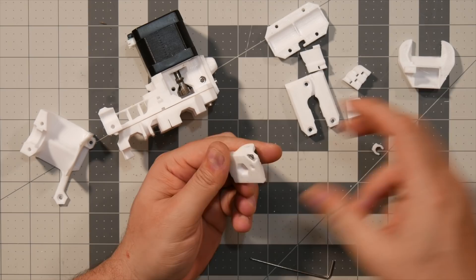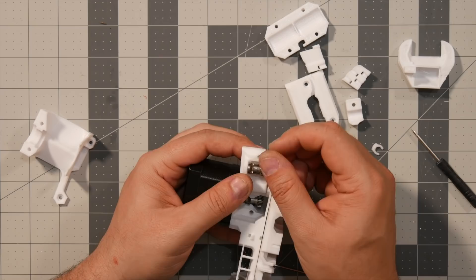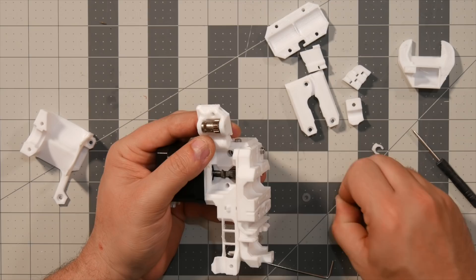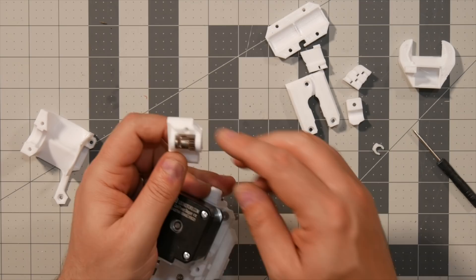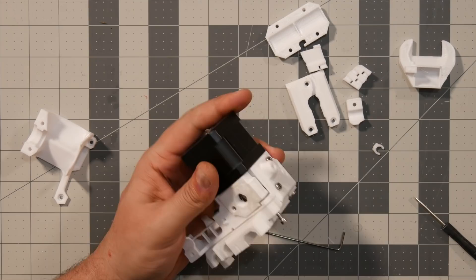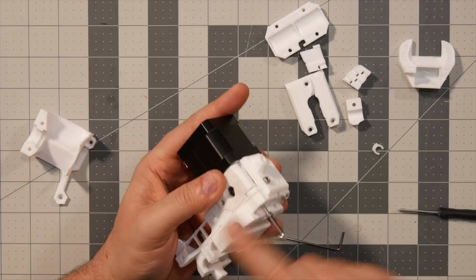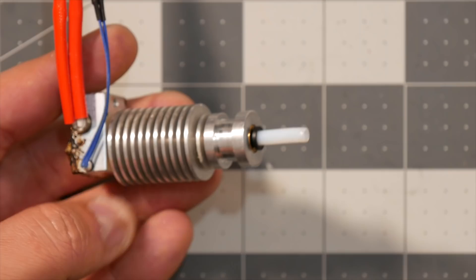Now it's time to attach the lid over onto this side. First, you need to insert a nylon washer — and just in case you don't have a nylon washer, it's okay to use a metal one. Put the nylon washer over the hole, grab an M3 by 40 screw, and push it through until it goes onto the washer. Get the lid ready, and before you push it all the way through into the extruder motor, there's the other washer you need to insert right between the stepper motor and the lid. Tighten the rest, but there's no need to completely tighten this because you still need to be able to open this lid. Before putting in the hot end, just make sure you insert this 3D printed collet so there's no give in the PTFE tube.